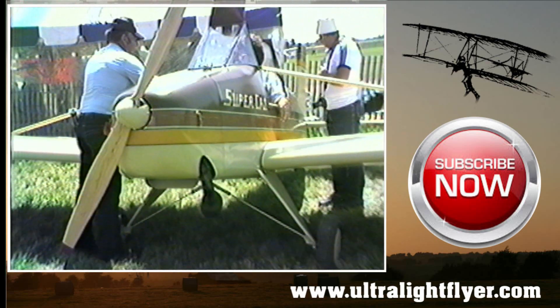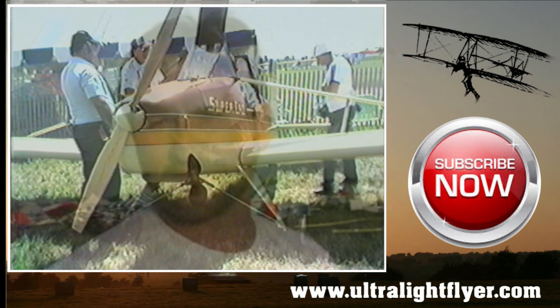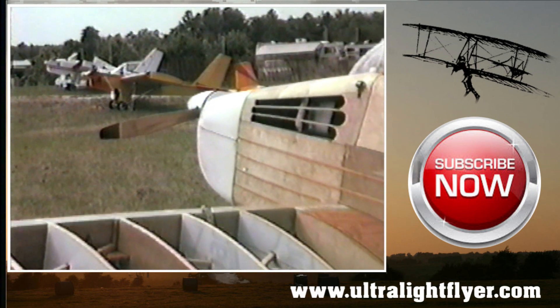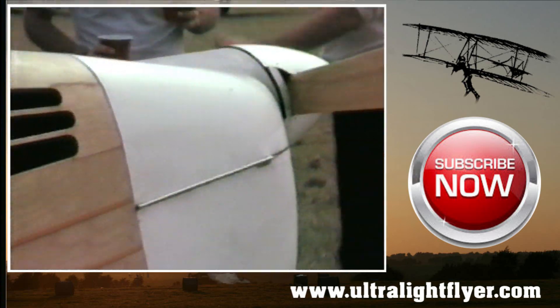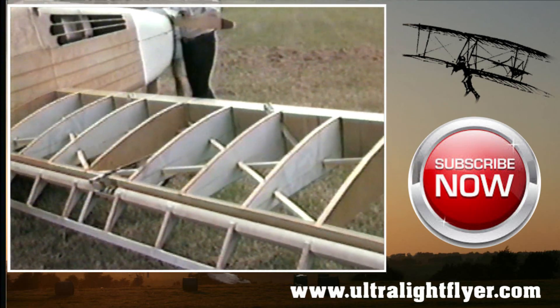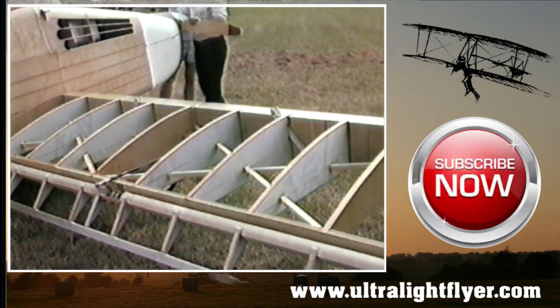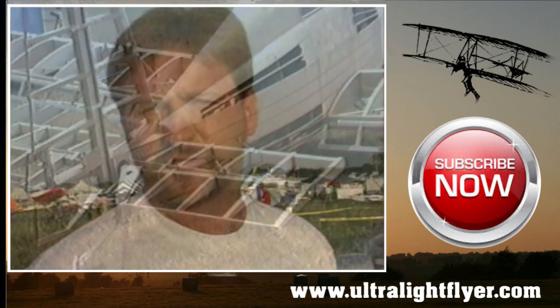Working from the plans — you obtained those from Bobby Baker. How do the plans come? I got the plans rolled up in a tube with a construction manual and basically good luck. The drawings for the bulkheads are full scale — you just cut those out, glue them on your plywood and cut them out. Anything critical like wing rib templates are full size. The rest is subscale but gives you dimensions so you can make the parts.